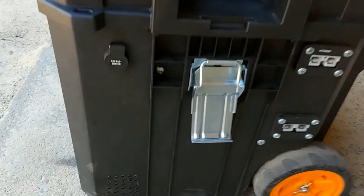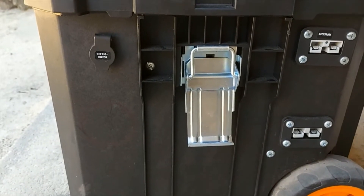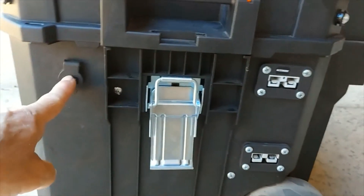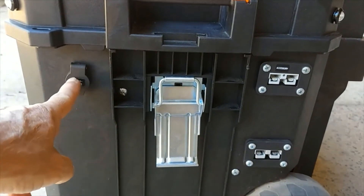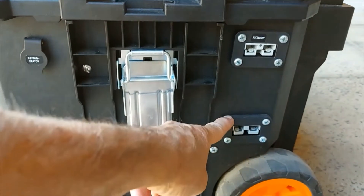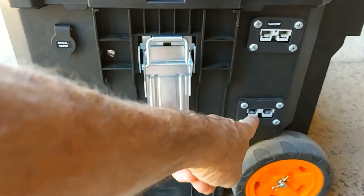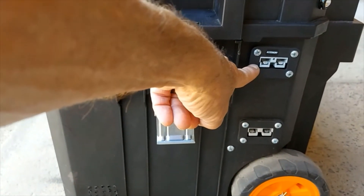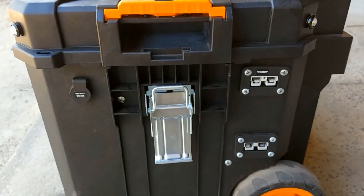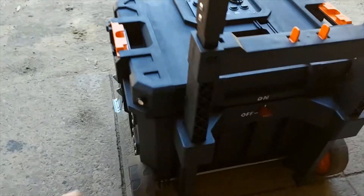Around the side there are a couple of air vents at the bottom. I've drilled holes in each corner so it can get fresh air for the inverter when the cooling fans kick on — it doesn't really get hot if you don't overload it, but it still needs some fresh air. There's a Merit plug here, which is a 12-volt outlet similar to a cigarette lighter plug but more secure, better fit, less likely to accidentally come undone, and more efficient. There are Anderson plugs — one is an input to my 30-amp MPPT solar controller so I can plug my solar panel straight in to charge the battery. The other is a 50-amp plug wired through a 30-amp fuse, which is adequate for almost anything you'd want to plug in, including a mains charger — I've got a 30-amp mains charger I charge it up with.